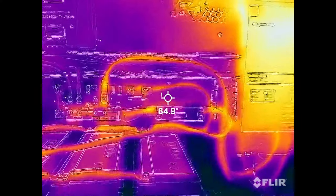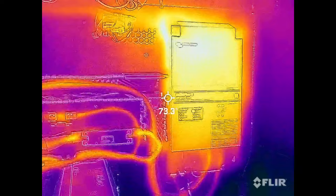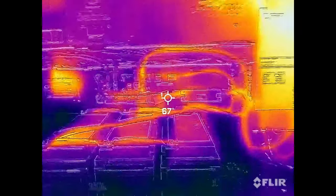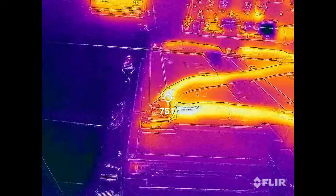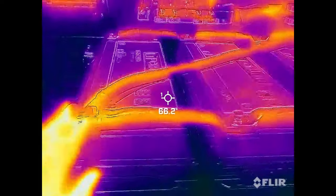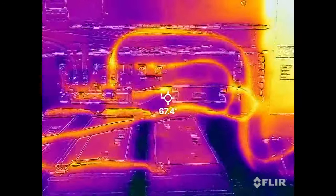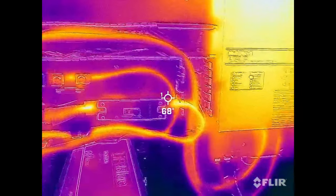We're going to forego adding additional solar to what's already on the roof — just make sure it's all hooked up and working correctly. Running about 150 amps. We're calibrating some of the hot spots here. In the grand scheme of things, the inverter is the hottest spot, and interestingly enough, the servo over there on the left. We're getting a concentration here — all of 75 degrees. That's why I like to use this FLIR system: it finds things you can't feel or see. I'm really happy with this new breaker system we're using — it just stays cool as a cucumber.